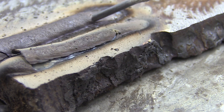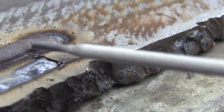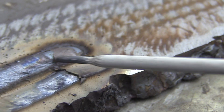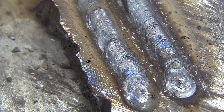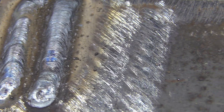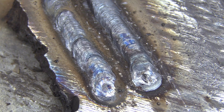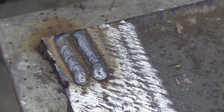We're just going to flip this out of the way. The slag peels off really nice when everything goes as planned. On the left is the proper way and on the right is the not-so-great way. You can see that big crater at the end of the one on the right, and the bead profile seems like it's too tall — it didn't really flow into the base metal like you'd want. So that's a quick tip for today. Thanks for watching.